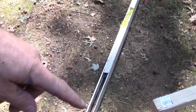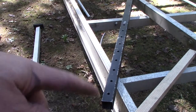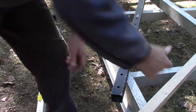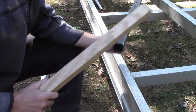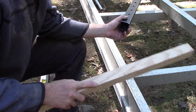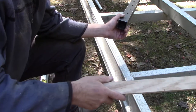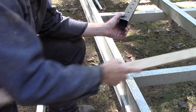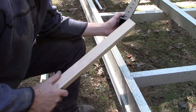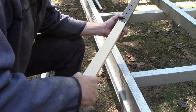It's going to be an oak-filled aluminum spacer - oak is fine according to Tom. They still use oak as a separator between the bed and frame on commercial trailers, which is what gave me this idea. I used Douglas fir for the rails, but the fir wasn't thick enough here. The oak fits perfectly as the spacer. When the axle sits on top of that it'll still be steel to aluminum, but I'll paint that with plastic coat or wrap it with gorilla tape to stop the galvanic reaction.